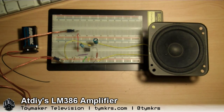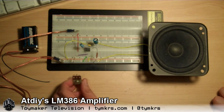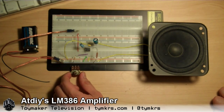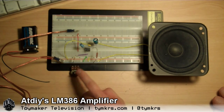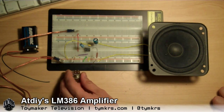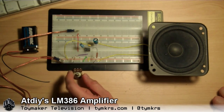To do this you're obviously able to read resistance values and capacitance. I had to pull up some charts for that. And I actually got one of the portions wrong because this is an 11K resistor and there is an arrow to it in the schematic, which technically meant that I needed a variable resistor or potentiometer. I just kind of made that mistake, but it still works — it just means that resistance is at max.